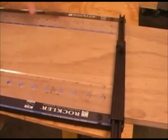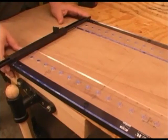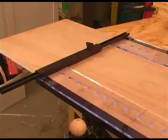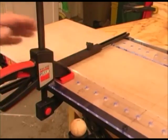Make sure the guide bars are firmly against the wood and tighten the locking knobs at the top and bottom of the jig. I like to add one little extra step for security — I add one speed clamp near the bottom just to secure the jig so I can't bump it out of alignment while I start drilling.